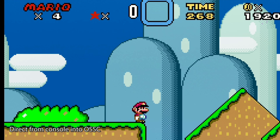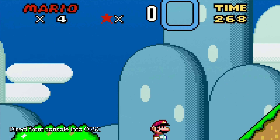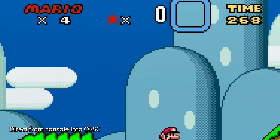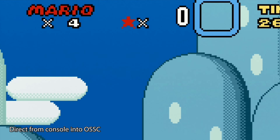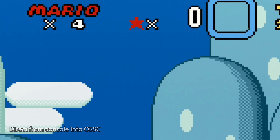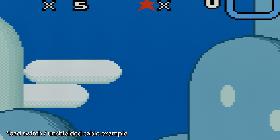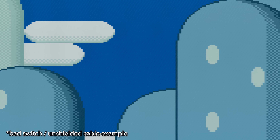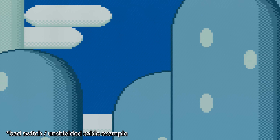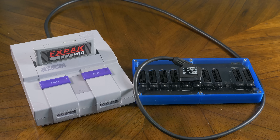Keep in mind that all analog signals will show interference when we zoom in this far. These captures were taken with my usual methods, and all images are integer scaled to this video. This is actually a very clean solution overall, and in contrast, here's an example of how a bad switch looks, like some of those older Bandridge switches. The reason the switch does this is exactly the same reason an unshielded cable adds interference — the colors in the composite video line bleed into the blue line, and this interference is the result.